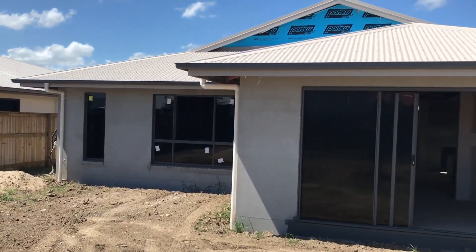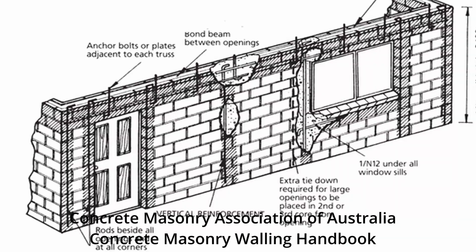In a house, those loads are wind loads or people loads. Typically we have vertical bars at nice even centres at around 1 to 1.4 metre centres, and then we have strong posts along the top which we call a bond beam, and we run reinforcement in those, and we have reinforcement above and below windows — all those places where walls will want to crack.